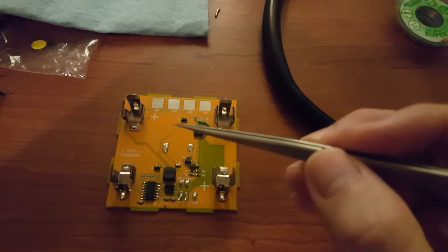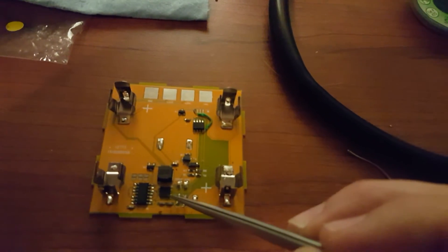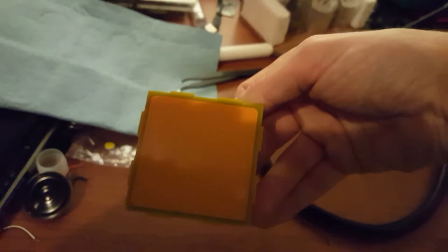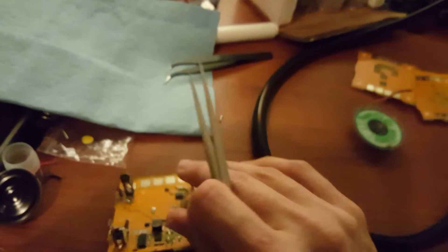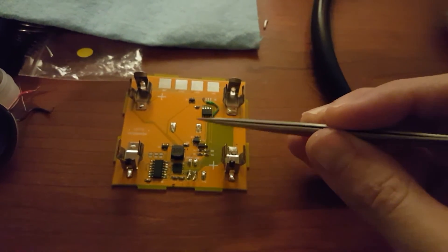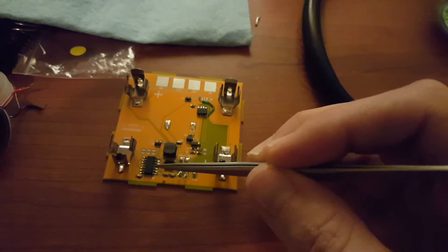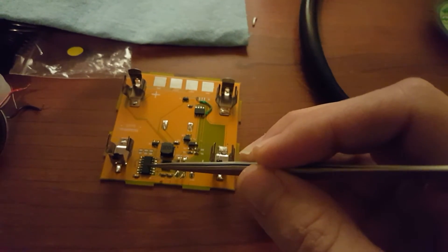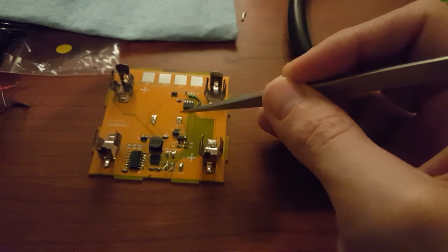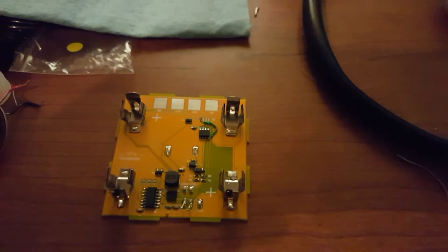So this is our circuit board here. It's going to be on the bottom of the ornament. We have a Silicon Labs microcontroller that's going to be doing some cap sensing. The bottom of this board is basically one giant cap sense pad. We have a double EEPROM up here which we're going to use to store some audio files. The PWM module on this guy is going to send some output to our line buffer, which is going to boost the signal strength, send it through this LC filter, and to a speaker attached to these two pads, which I've depopulated for demonstration purposes.